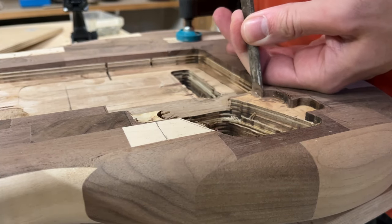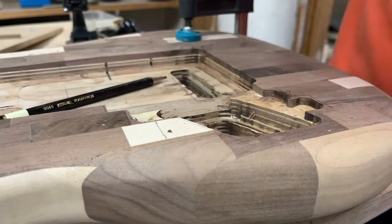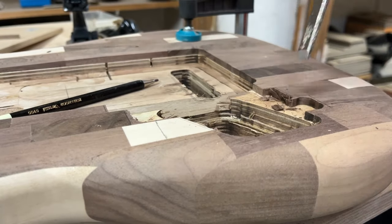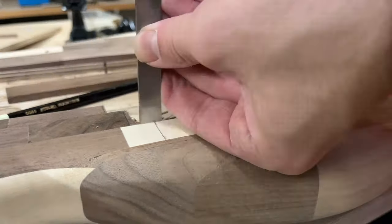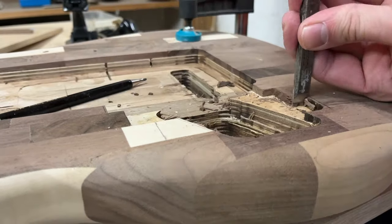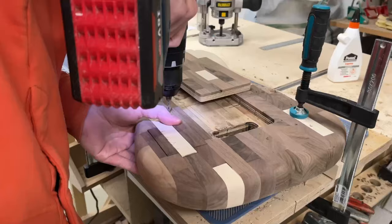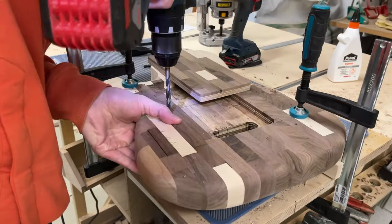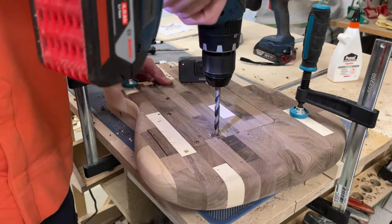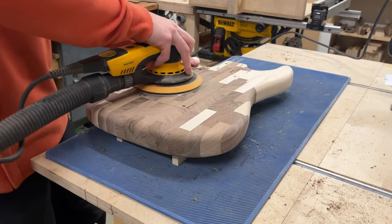The components that are to go into this inlet are too high for me to make the cover as in the center. In order to still achieve the look of a closed, uniform body, I made use of my strip design and produced matching strips that could be screwed on as a cover. Fortunately, this milled opening is small enough to avoid having to use conspicuously long strips. After a proper sanding of the installed covers, the openings are still visible, but pretty enough that you will never see them while playing, at least for me, and hopefully for my father as well.